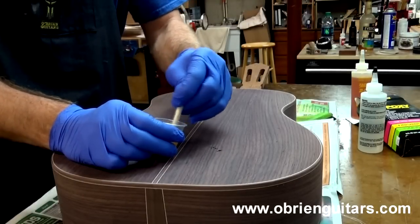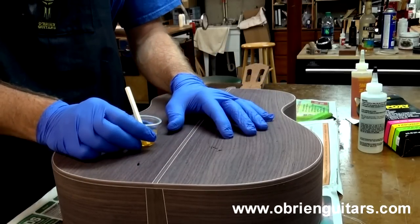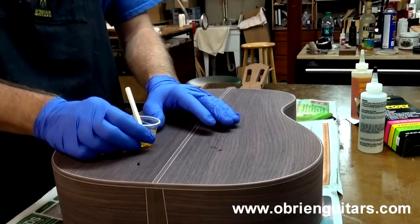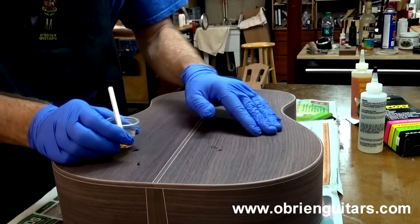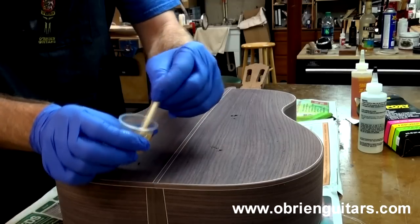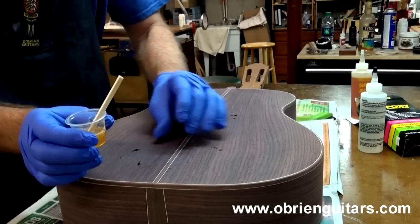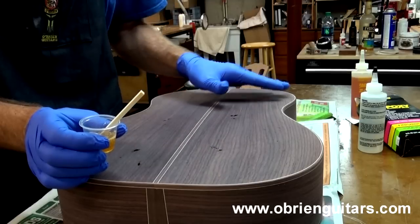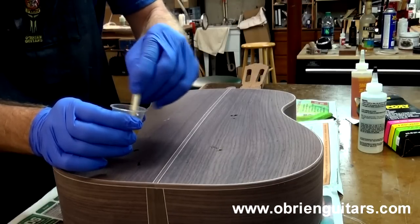There are several different ways to apply epoxy. The way I like is to put it on and let it sit overnight. I'll scuff sand it the second day and apply a second coat. After the second coat I sand it all the way back to bare wood — this avoids compatibility issues with top coats. Some people mix a third batch diluted 50/50 with alcohol and wipe it on with a paper towel to even out color. You can also add a seal coat of shellac over the top if you're concerned about compatibility, but I prefer sanding back to bare wood.